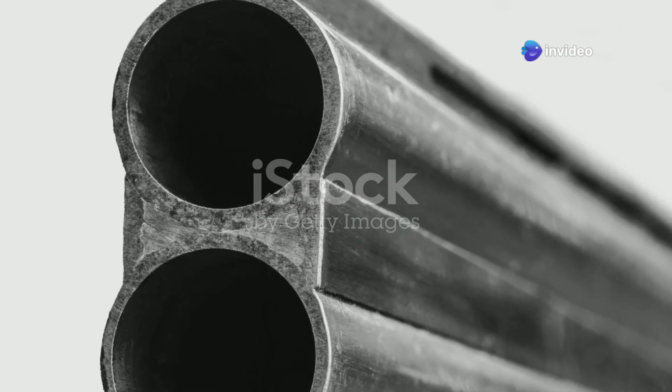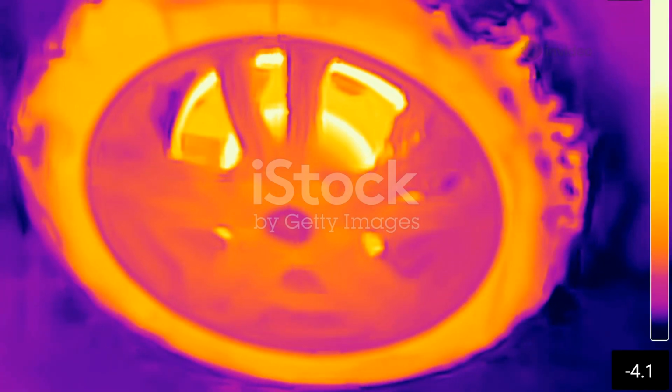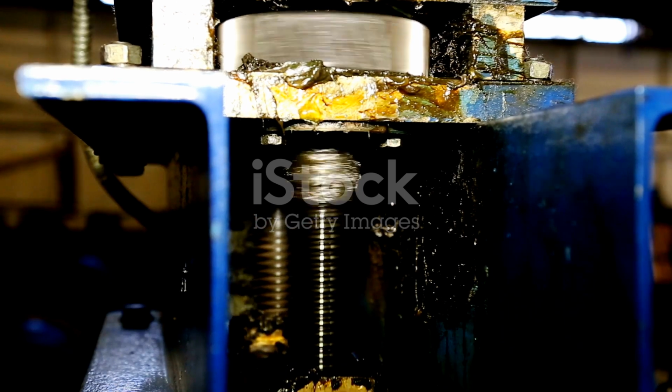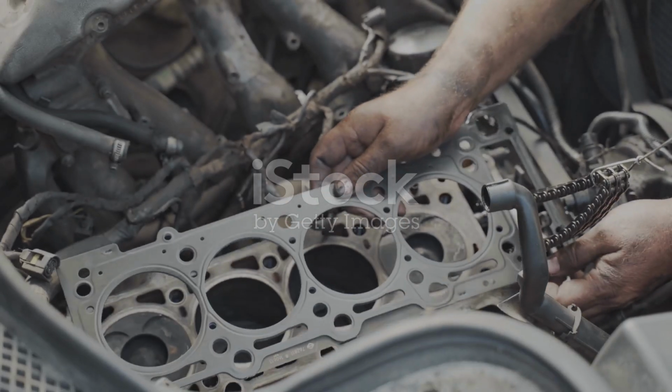Some engine cylinder barrels are choked at the top, or they are smaller in diameter, to allow for heat expansion and wear. In some instances, the barrel has threads on the outside surface at one end so that it can be screwed into the cylinder head. The cooling fins are machined as an integral part of the barrel and have limits on repair and service.